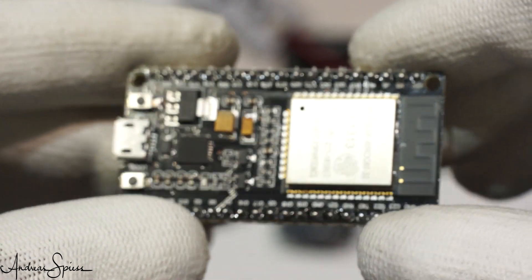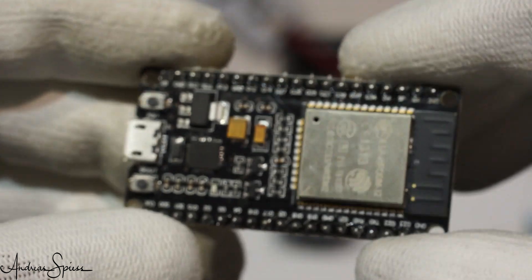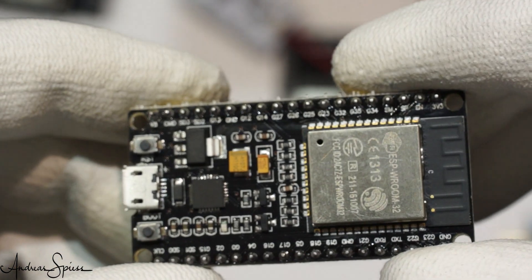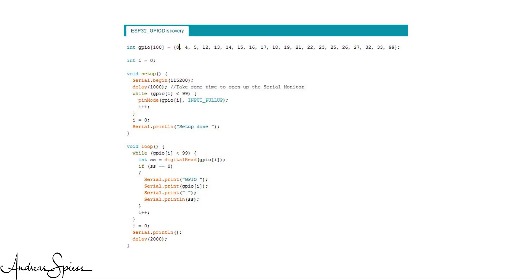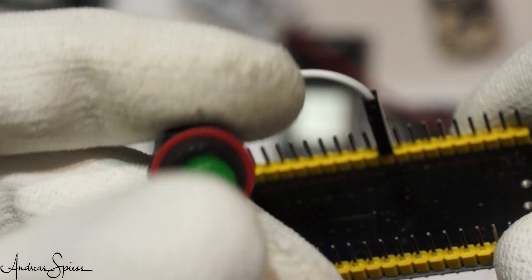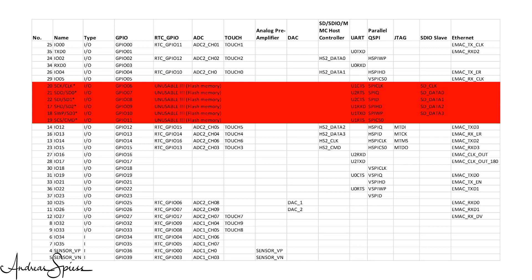The next board is very similar to the NodeMCU, but with a Revision 1 chip. The labeling is on top but a little strange — GPIOs are labeled as GXX and some pins use other purpose labels, so you always have to find out which GPIO corresponds to which pin. On my GitHub, you find a small sketch to identify which pin maps to which GPIO number: connect a button switch between one pin and ground, start the sketch, press the button, and you see which pin changes state. You must not define all GPIOs as input, otherwise your chip crashes because you interfere with the flash chip interface.